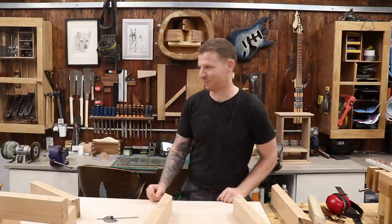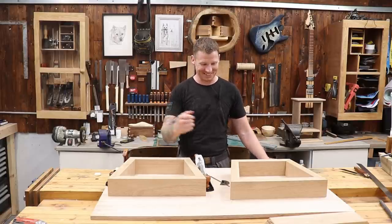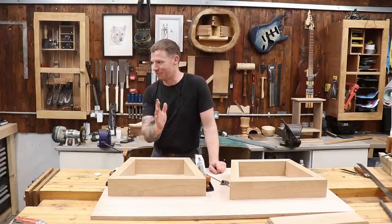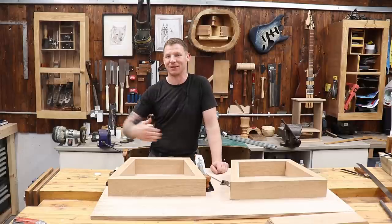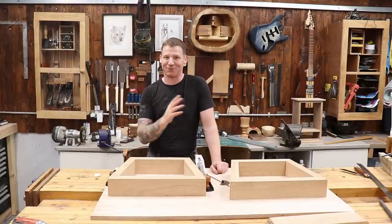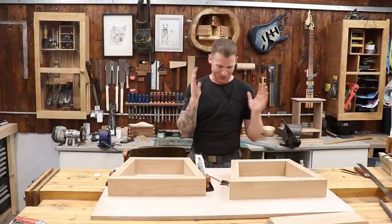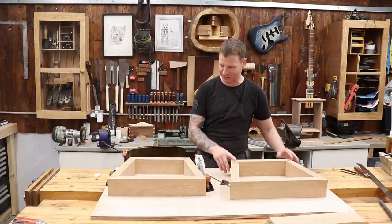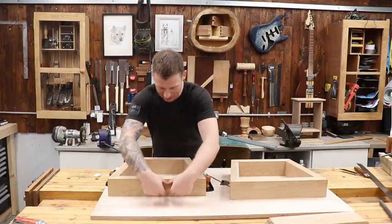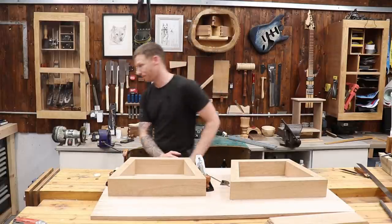There we go — our two trapezoidal frames are all cut, and I finally figured out how to use my mitre saw. I put it out on Instagram and a few carpenter friends thought it was absolutely hilarious. You're measuring off your zero degrees or 90 degrees — so if you set it to 40 degrees it leaves you with 50 degrees, and if you set it to 50 degrees it leaves you with 40 degrees. I mostly used it for straight cuts and 45s before, so it never occurred to me. We have two nicely fitting frames — now I need to route in the unistrut slots before gluing.